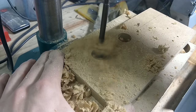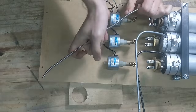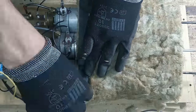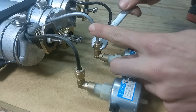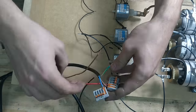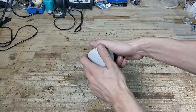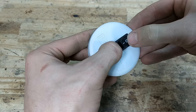Finally it was time to assemble all the parts into one machine. After laying out the components to make sure everything fit nicely on a piece of MDF wood, and after a lot of drilling and screwing, I had everything secured in place. Next I wrapped the heating blocks in rockwool insulation to help them maintain their heat — I used rockwool because it's heat resistant and won't catch fire. Once done with all the plumbing, it was time to work on the wiring. I then made a simple controller using a switch and a small lamp to indicate when the heater reached 260 degrees, so it can't fire prematurely.